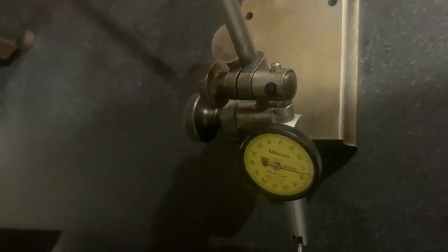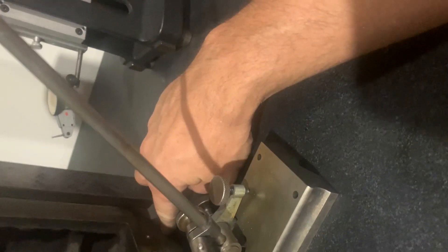That is 0.12 millimeters of tip in that reference face relative to those ways. The reference face is tipped like this, which tips the ways the other way. In order to determine the best way around this — whether I re-scrape that reference face, take more out of one side or less out of the other.